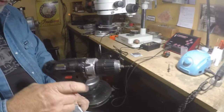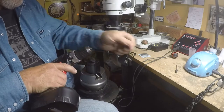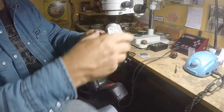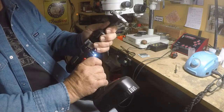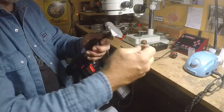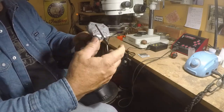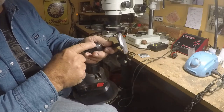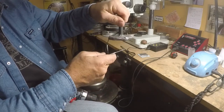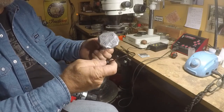I found it on YouTube. And it's just a half inch disc with some magnets on it, and I'll tell you about it in just a second. I don't put it in this drill. This drill won't hold it, but I've got a half inch drill I put it in, and I spin it real fast. While it's spinning, I put the graver underneath it, and it has north and south poles, and that switching of the poles rotating above the graver demagnetizes it, the way I understand it.